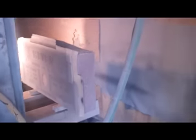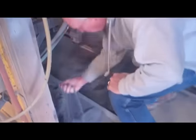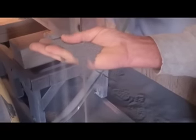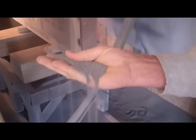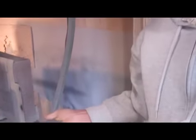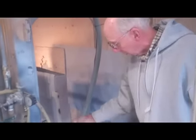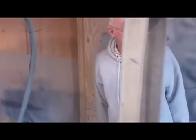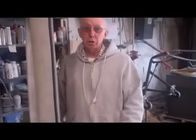Then we stay outside. We use a man-made abrasive that's made in electric furnaces. It doesn't break down very fast — it might last quite a while. We use it over and over; it eventually gets broken down and gets dusty. We have an exhaust fan dust collector that pulls the dust out of the room.